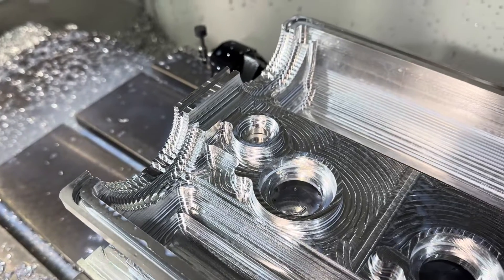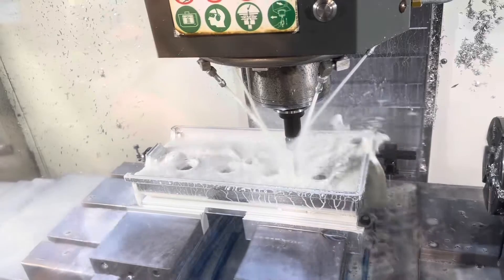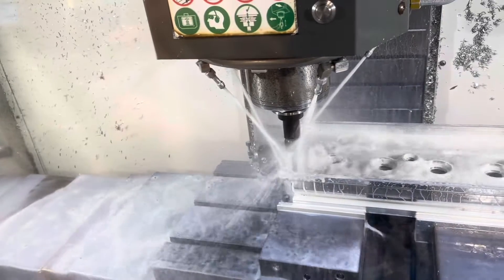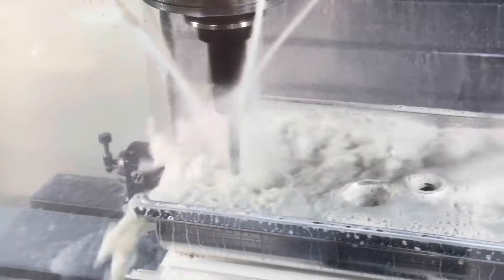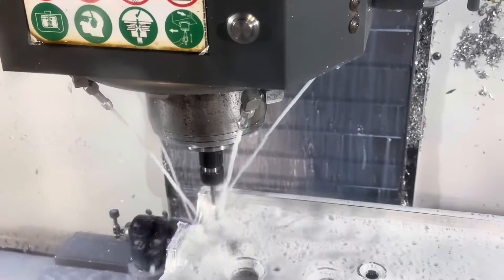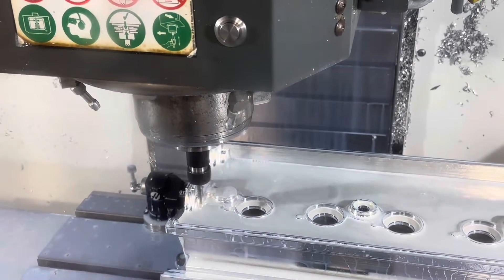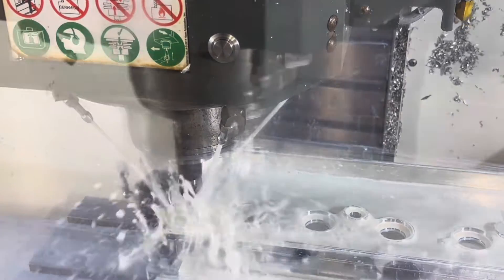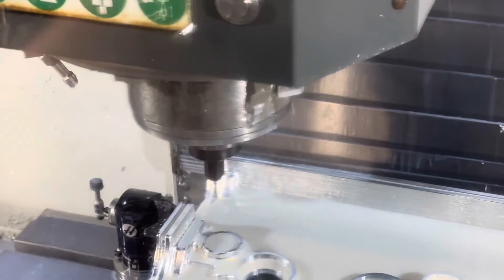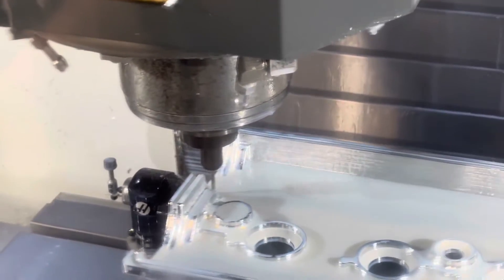Here it is roughed out. Just like the top side, I go back in with a 3/8" ball nose sticking out pretty far and surface all of the features on the inside of the valve cover. When I was designing this I wanted to make the inside as smooth and nice as possible, even though you won't really see it. The cycle time on the inside is about double what it is on the outside, mostly due to all the small tools used to surface the little features on the inside that don't exist on the outside.